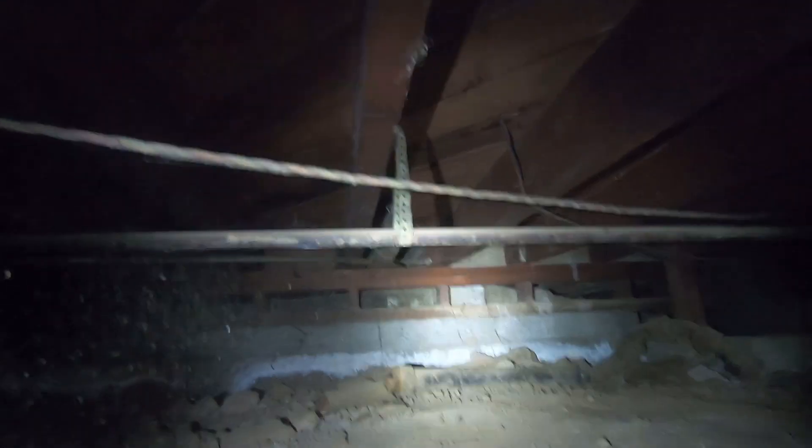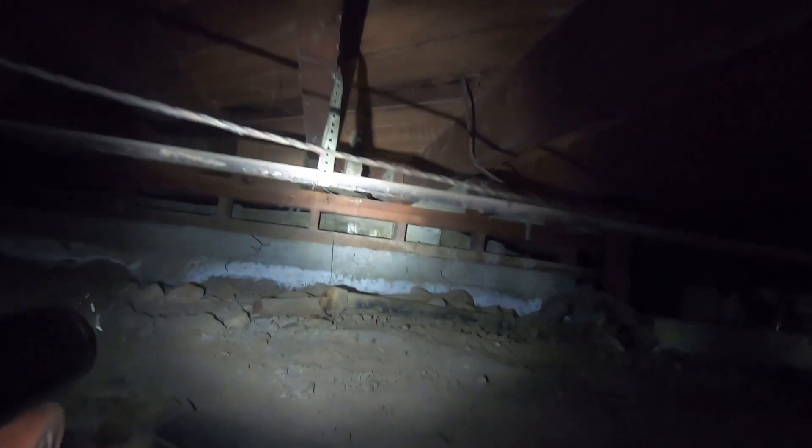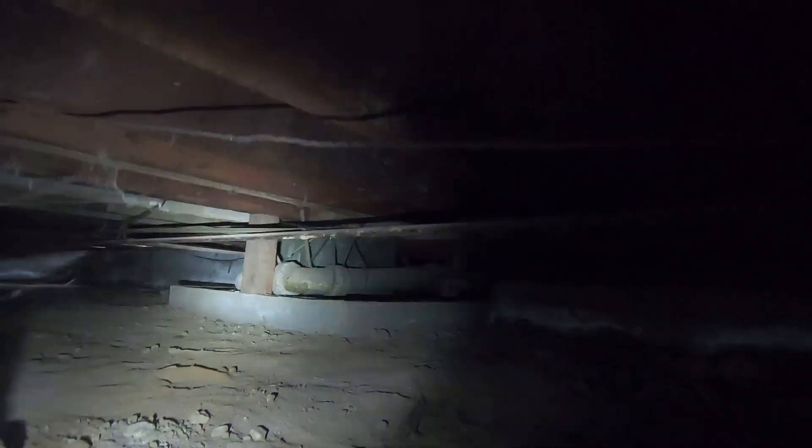I haven't run into any snakes but I don't want to bump into anything with sharp teeth. Underneath the house I noticed there are two floor heaters — floor slash wall heaters — both sharing the same vent pipe. Sadly, I was planning on using that as a shaft to run my drain lines, line set, and gas line, but I'm gonna have to go with plan B, which is to go up through the line set cover. They still want to use that wall heater, so I'm gonna have to get the gas from this floor heater and run it up to the side of the house into the attic.